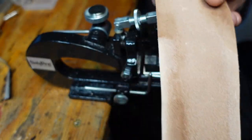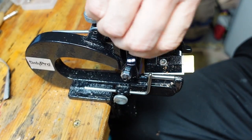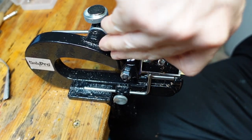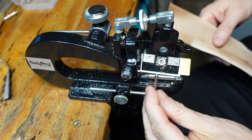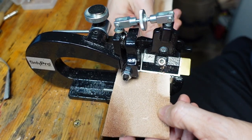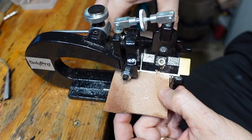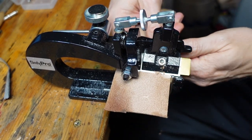So you get that done, and you have this little excess left. You could, if you can get it set up the same, reverse the angle like so. Bring your edge guide up that way. And now, you can pull it through the opposite way. Now getting that edge set the same, it's just a matter of matching it up with your previous cut.